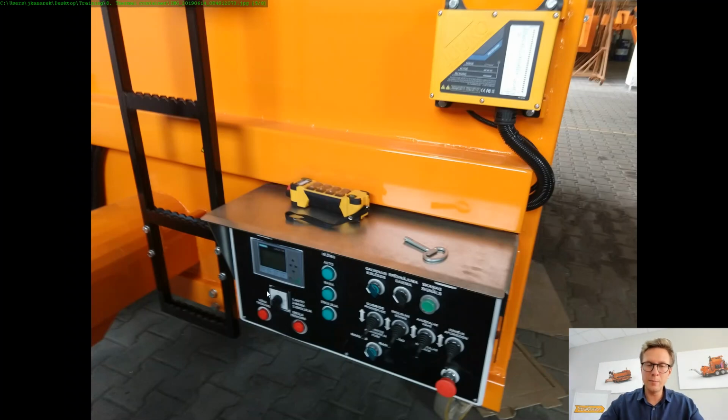Now, going below we see the main switch of the main modes. So we have auto, we have the asphalt mixture, and then the emulsion. What it does for us is that if we want to work in non-automatic mode and we have no emulsion, we can simply make sure that this heat distribution system will focus on just the hot asphalt mixture container. On the other side, if we want to use only the emulsion for spraying and we have no hot asphalt mixture, we may force the heating only on the bitumen emulsion compartment. All of the other switches are dedicated to either safety issues like the horn or the warning lights, or opening the other doors, turning the augers left or right. Very simple, very clever, and very clean, I would say.